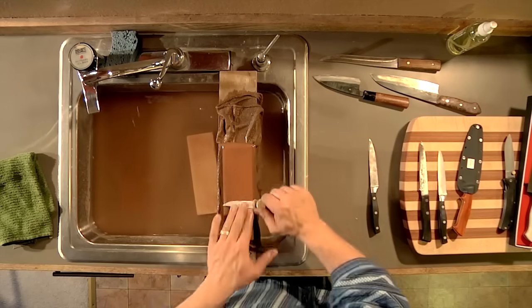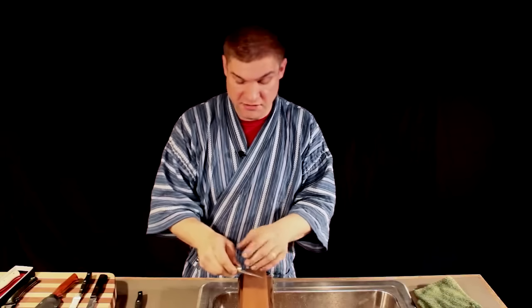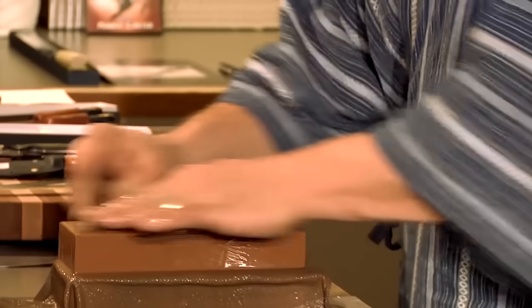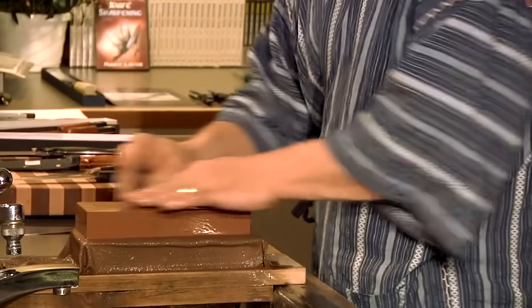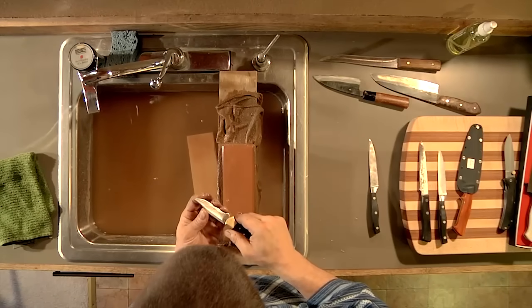So to preserve the longevity of this blade, to prevent grinding it away prematurely. I mean, theoretically, I could just grind until the blade's gone. Well, that would be a waste of time and the blade. So I only need to continue grinding here in step 5, a primary edge, on those areas of the blade that are still slipping.